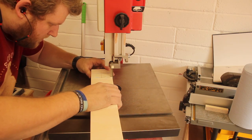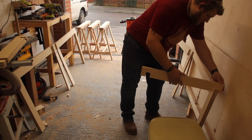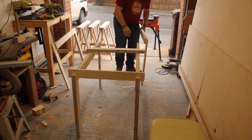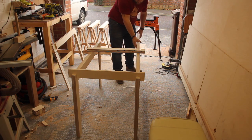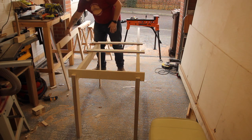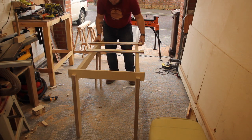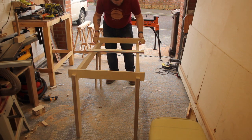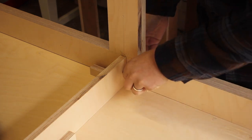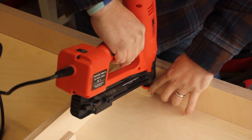I don't know what the joints are called that I'm using here, but basically I cut a notch out of each piece so they would fit flush together — and you can see it works quite well. I'm measuring out the notches to cut in the leg sections. I've done the top three braces and it's starting to come together nicely, showing how it will be able to seat a lot more people than it originally would have. Then just a quick nail and glue to add a few more of those in just to stop it sliding.